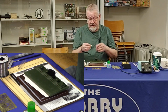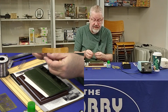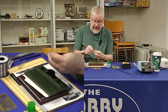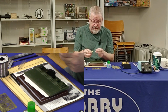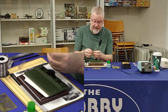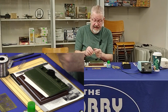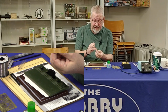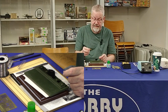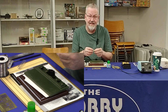I do have one here that I assembled probably many years ago, and that is completely done, completely soldered. We will have close-up photos or a video of this added on later. Again, another stowage bin. It has the main body as one piece that was bent around. The top, the lid, is a second piece. It has 3 hinges and 2 clasps, but also the little locking hasp in there as well. So it's quite a number of pieces. They're all soldered. If you use your assembly of soldering properly, you won't disturb previous soldering points.